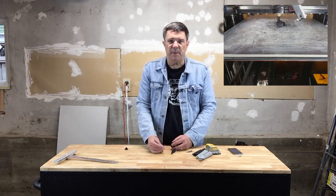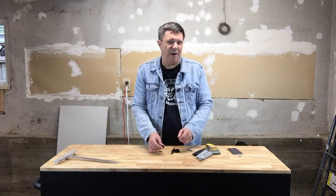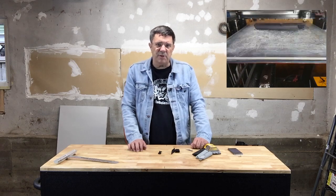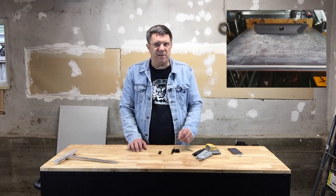If you don't like a plastic bolt, it's a standard quarter-inch thread, so you can always use a metal replacement. We find that plastic works just fine, and we've even included a mini star-shaped screwdriver, because in our projects we like to rely on as little as possible beyond what our 3D printer can produce. We printed all these parts in PLA for a 0.4mm nozzle, two perimeters, three top and bottom layers. For the handle and cartridge we used 20% infill, and for the bolt and screwdriver we selected 85% infill to give those parts the extra strength they need.